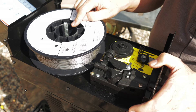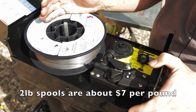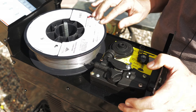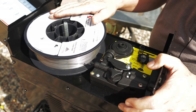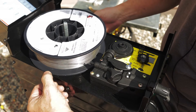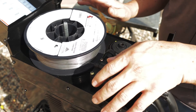The two-pound spools from Harbor Freight or elsewhere are more expensive per pound. Lincoln wire is really expensive and you only need that for multi-pass work. This E71 T is not for multi-pass — apparently if you use it for multi-pass, your weld will become brittle. As you can see on the edges, a 10-pound spool just barely fits, but Harbor Freight did make this machine capable of running one from the factory.